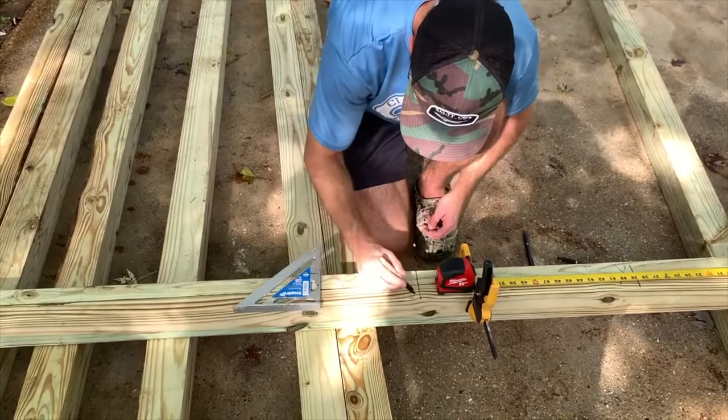After attaching the guide to the curtain barrel on one side of the roll-up door, move on to the other side and repeat the exact same process, using the provided hardware and adjusting the curtain barrel as needed to get the bolt through both the guide and the curtain barrel bracket. And once you get it positioned where it needs to be, thread the bolt through and then thread the nut on the other side. And hand tighten for now, and we'll go back later on and tighten it up with a socket wrench.